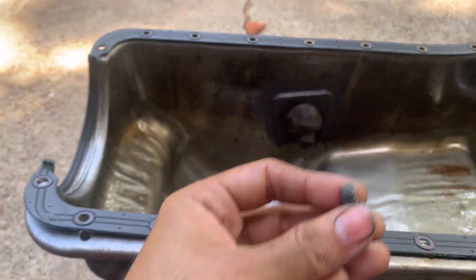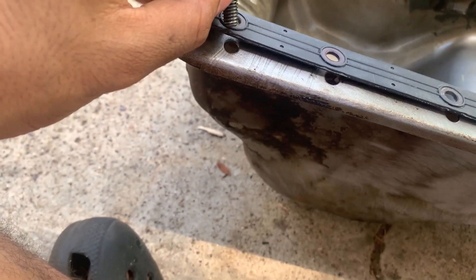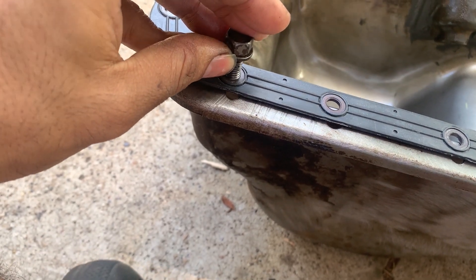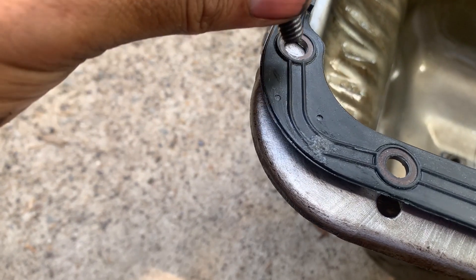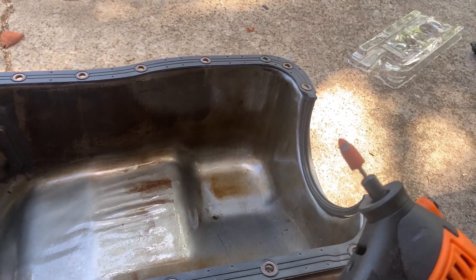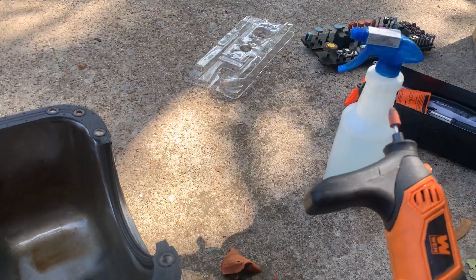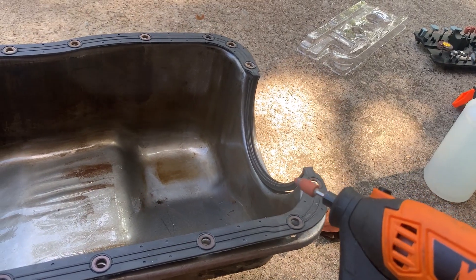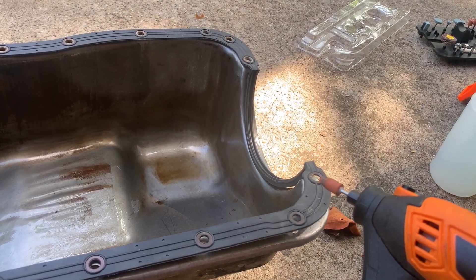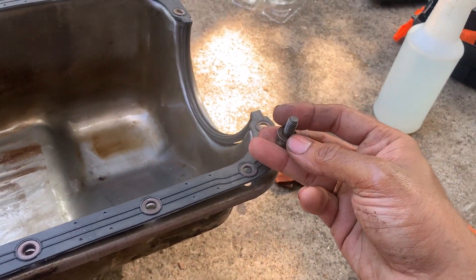Here's the 5/16" bolt, and as you can see, it's not going to get in there. What I've done is oversized them so they'll go through just fine, and it was pretty easy. The way I did it was using my Dremel with a honing bit — I just went from one side to the other, back and forth, kept it cool with a little spray of water. Each one took maybe a minute at the most and oversize pretty easily. So there's my solution to that.